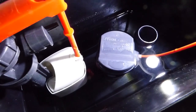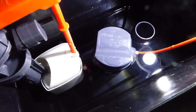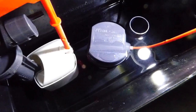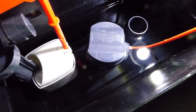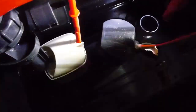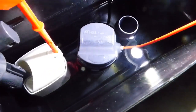When that happens, you will get this kind of running on of the flush full pelt. Now, this has nothing to do with the other problem you can get when you just get water running in the back of the pan - that is a different problem altogether, that just happens all the time slowly. And that is usually because you have a problem with either the ball cock - the valve there - letting by slowly and going down the overflow, or the siphon itself has got a problem.